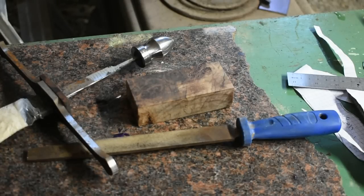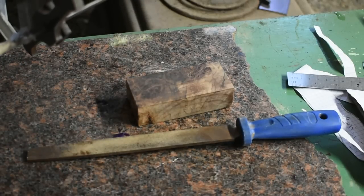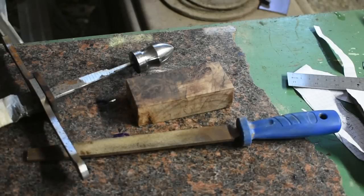I did suffer edge damage due to a bad forge weld, but my all thread that I welded in did not break. I've done this on a lot of different projects, and it works just fine. The weld's good and strong. It's the same thickness as the tang is, so it's not weak. So we should be good to go. This is a dagger after all. That being said, that rant aside, let's get the handle drilled out and get it fit up so we can get it rough shaped.